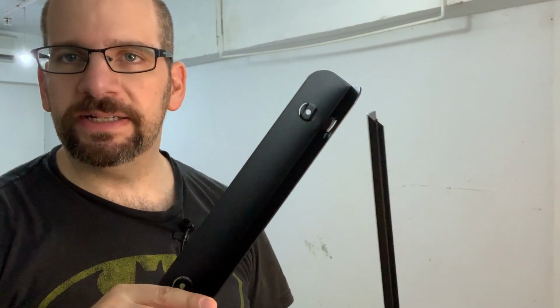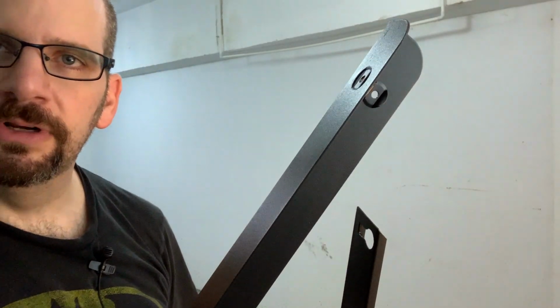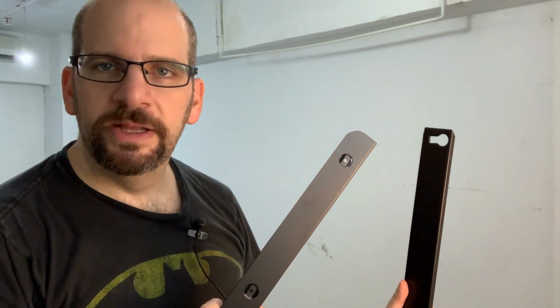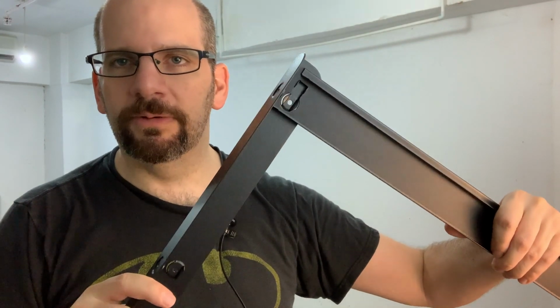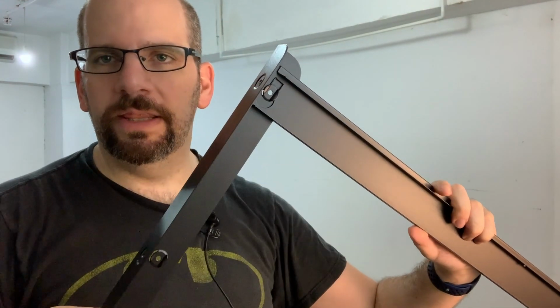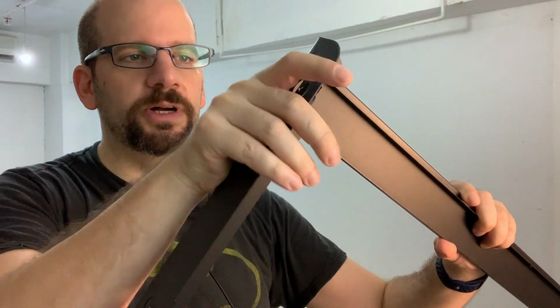Okay, so I got some of it unpacked, and I want to stop here to tell you a little bit more about how this thing works. First of all, it's really lightweight metal, not too heavy duty, and it's all basically stamped like this. So they've sort of made a fastener system out of this. So basically by punching a hole and bending the metal a little bit, as you can see here, it's a little bit hard to see because it's black. But basically, this piece, so this is a horizontal one, this is a vertical one. This horizontal one has a hole with this kind of notch cut into it, and you can already imagine how it fits. So basically, this thing goes on the round one and then slides down, and it's actually pretty simple, basically like that, right? So if you do this on each corner, and then there's cross beams here as well, and all the shelves and whatnot, it gets to be pretty strong because it's one unit, and then there's a crisscross piece as well. So it's pretty simple, and that saves a lot of screwing and tightening as well.